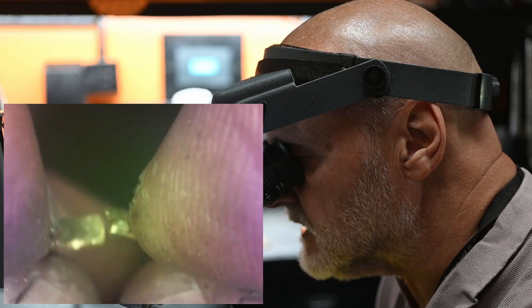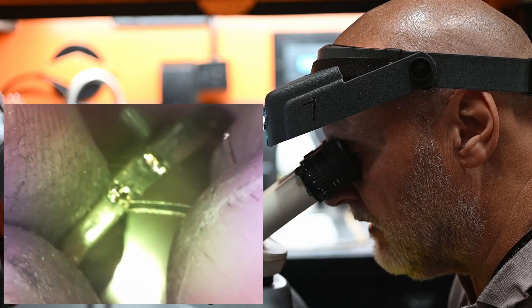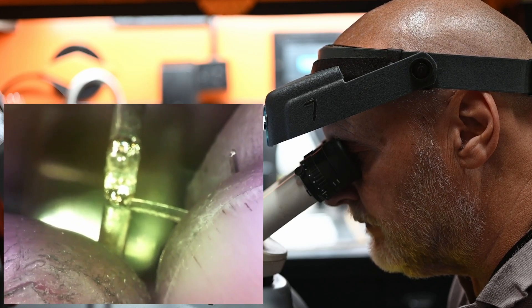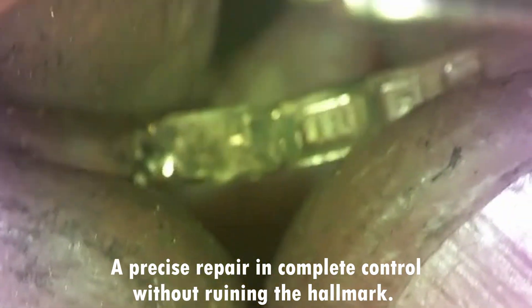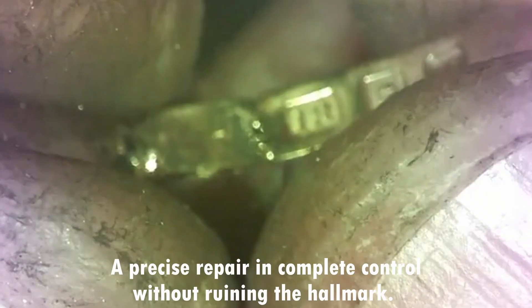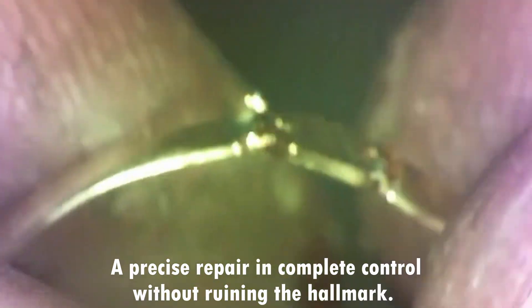My next tack is the other side — I'll reduce the power back down again. I'm now adding material on the other side. You have to be careful not to overpower, because you can end up blasting a hole through it, so you've got to get a feel for the settings. A little wiggle and a mush. Turn it over — you see how close that hallmark is? That's the beauty of the laser. I've got no issues with that whatsoever; it's not going to go anywhere near it. I have complete control, and I think that's the important thing.